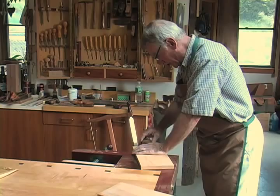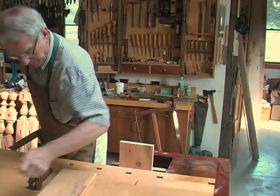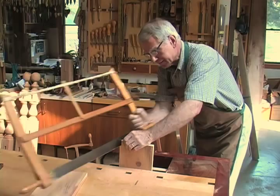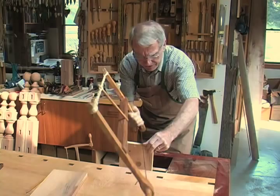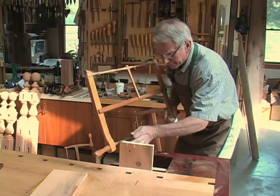You gotta come and watch this close-up because you're never gonna see this in your life. So we cut dovetails like this — use a pencil to mark from the pins, you mark the tails. First we cut a half pin, another half pin, a full tail. Cut this in turns approximately, and cut more pins, and you cut it out.